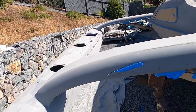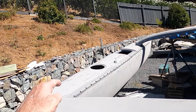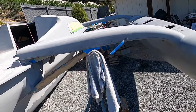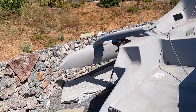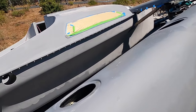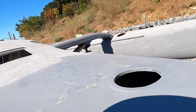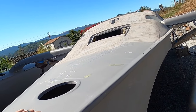It's Sunday morning and apparently the aliens took over my mouth last night — I told you I could just sand this out and get it ready for paint today. No. This hull is done up to 220. Gotta do the other one now, starting with 120 then 220. Beams need to be started. Then I have to climb under the boat and do the whole thing — 120, then 220. After all that, the entire boat needs a 320 sand. And after all that I still have to go back and do hand sanding in all the nooks and crannies I can't reach with a machine. These were last night's little patches. It's the fourth time I've gone around filling pinholes — but that is the cost of doing a good job. Repetitive motion.